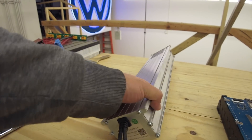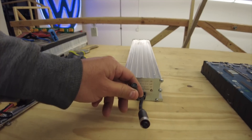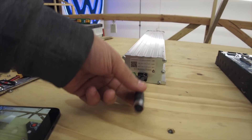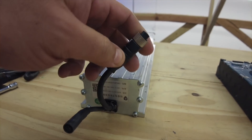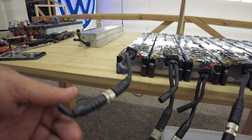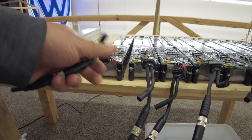The cells are literally encased in rubberized material. The problem is we still don't know how to use these as-is — the BMS inside is turned off. It seems simpler than the previous ones, but I'm pretty sure we're going to crack it soon and get the BMS to turn on. Once we do, we'll be able to use them as-is, because the connectors are intact. The guys who took apart these scooters didn't cut them. A lot of them still have the connectors on both sides, which is great.